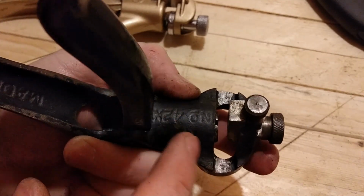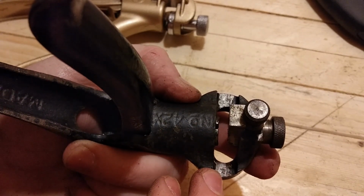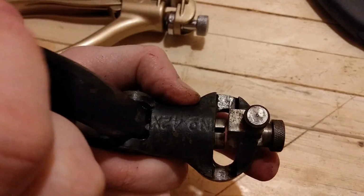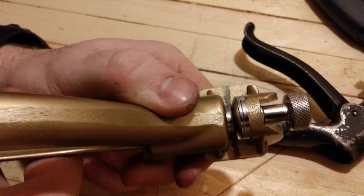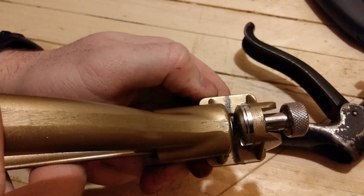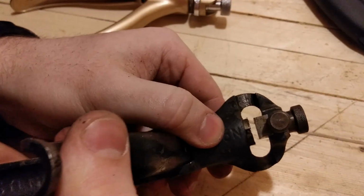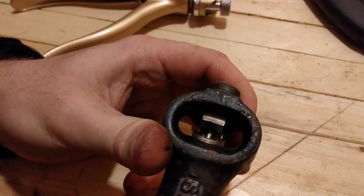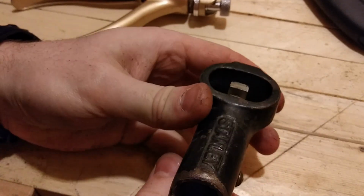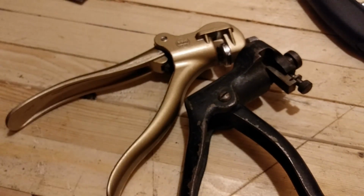That's pretty telling. That tells you that the teeth have the potential of getting blunted while you set them. I noticed the same thing with my modern one right here. You can see where the saw teeth were running on the body of the saw set. So that tells me I think your order of operations should be that you set the teeth, then sharpen your teeth, so you don't lose the crispness of the edge that you're putting on your saw.